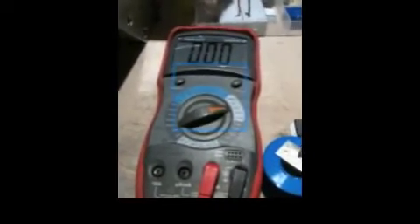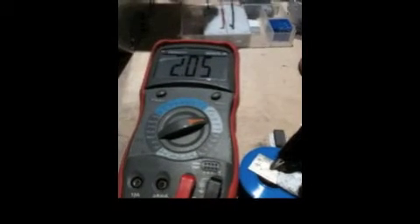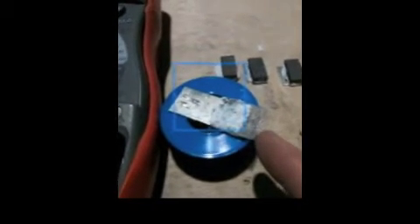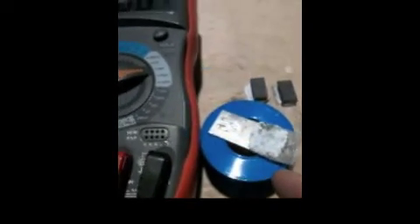Just to show you what this is doing from a voltage standpoint, I'll grab my electrodes and get a quick reading. Here we have the negative and positive terminal — we're showing 2.06 volts. Remember, that's a stainless steel electrode with magnesium, using carbon as the dopant. I've made cells before showing only 0.133 volts utilizing a stainless steel electrode, but using carbon as an interfacial dopant in that small stainless steel mesh obviously raises the voltage from 0.133 volts to over 2 volts.